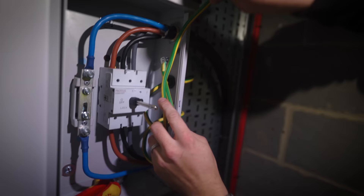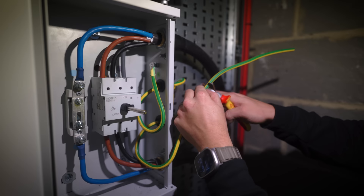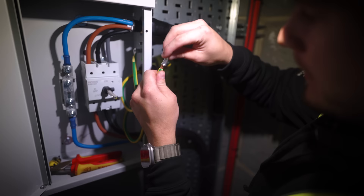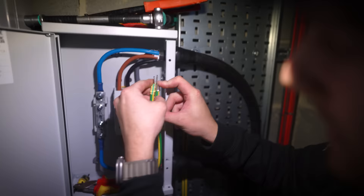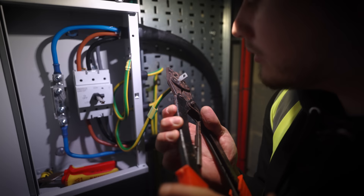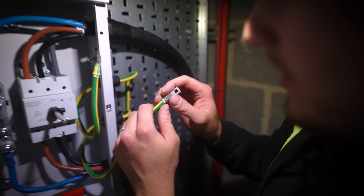Alright, there's one. We're going to twist that up and line up our second one. When it's stripped about there, we're probably going to want it cut about there. On this one I'm going to orientate the other way, like so, so it can sit back to back with this one. What that means is the lugs won't be fighting against each other too badly. That one's gone a bit low and deformed the lug — again, it's not the end of the world. That's definitely not going anywhere, but that's why you probably wouldn't double tap them.